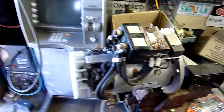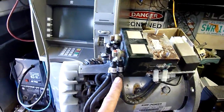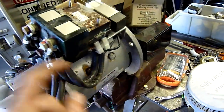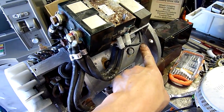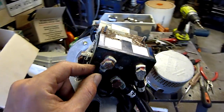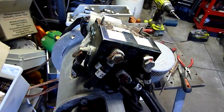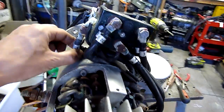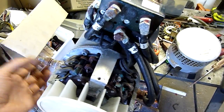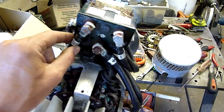I'm going to log all these cables. It's D1 — a pair of D1s — they go to the front of the field. D2 goes to the rear of the field, so those are the field windings. It switches the field windings and the brushes to reverse direction. A2 goes to — I think that's a main bar for the brushes — and you've got positive and negative going to the brushes. A2 seems to go down inside there somewhere; I'll find out when I take it apart.